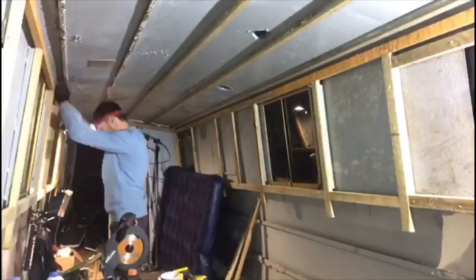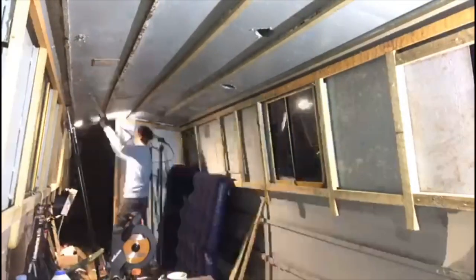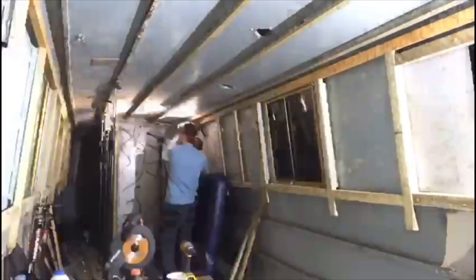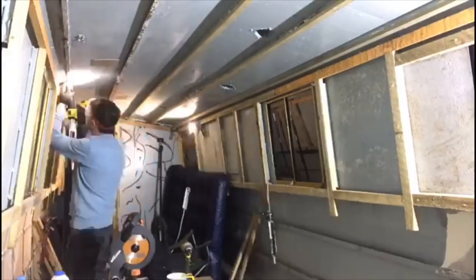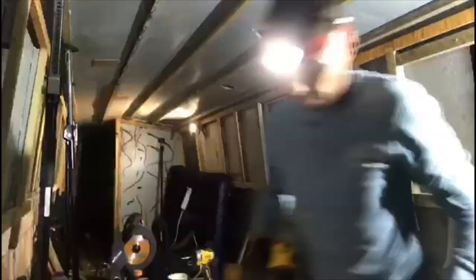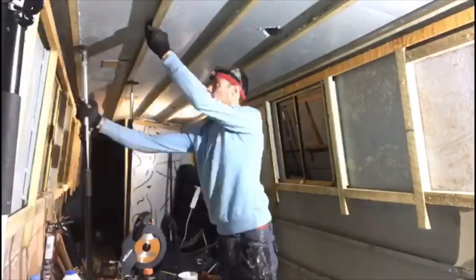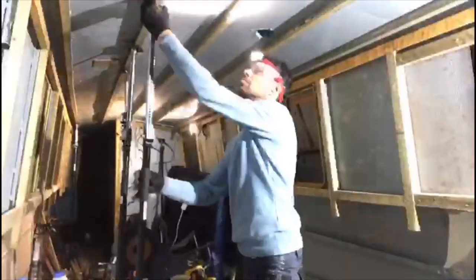First job was to clear it all out, scraping out the old insulation with my fingers. Using grip fill extra and clamps to put the battens in place — the steel the little L-shaped bracket was going through was probably three mil thick, so it went through quite easily. These clamps proved absolutely invaluable; it's kind of like having three people's help. Apart from it being a bit of a sore neck exercise constantly looking up, this battening went on quite nicely.